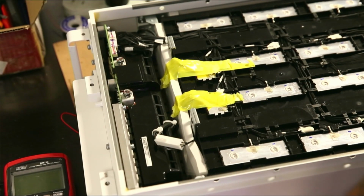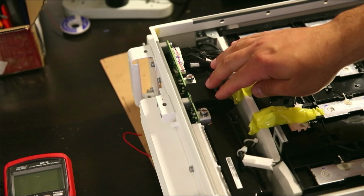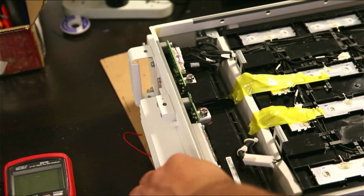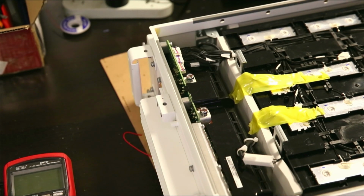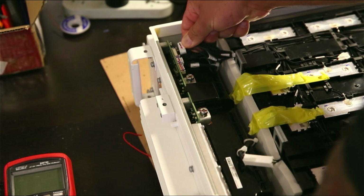So the way this battery works is it takes the 51 volts from the cells, goes into this, which has both rows of BMS and also DC to DC boost, and that gives you 400 volts at the output of the battery. That allows you to use thinner wires because the current is not that great. If you would have used only 50 volts and wanted to deliver 2.5 kilowatt, you will need thicker wires to do that. So I want to remove these connectors.